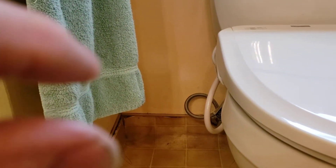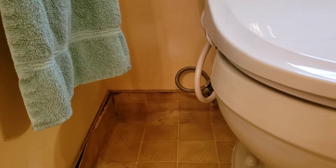The soil pipe was sticking out of the flange about a quarter to a half an inch, and we don't like that, so we did cut that off first. Then we put in some new bolts — quarter inch by two to two-and-a-half inch brass bolts.